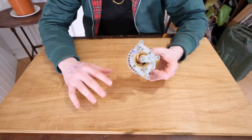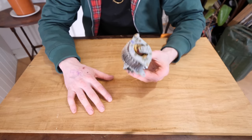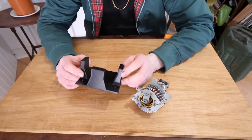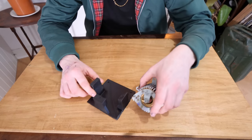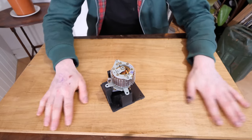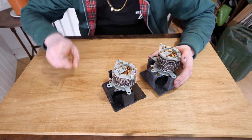So today we're going to make a machine out of a handful of these that is basically going to count to a million. A million's a pretty optimistic number, but you know, may as well. First off, in the light chaser video, you'll see this. I've 3D printed a few more of these. These are basically mounts for the Uniselector, so we can mount them onto bits of wood, like the bit of wood right here. Each Uniselector is going to be in charge of counting up a single digit.